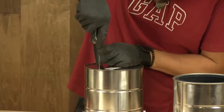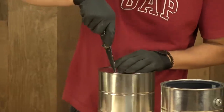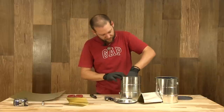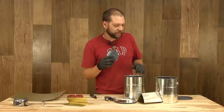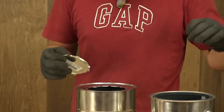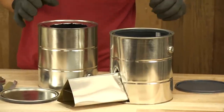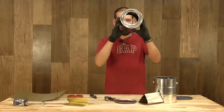We're just going to use the knife and cut it in like this, all the way around. Cut our hole in the bottom and we have this nifty little piece of metal. Now, the first thing that's going to degrade in your rocket heater is going to be the bottom of the can. So any extra metal that you have, throw it in the bottom so that it doesn't rust out — it'll protect it, because that's where your coals are going to be. It's going to get really hot right there. So now we have a hole.